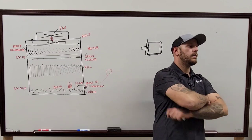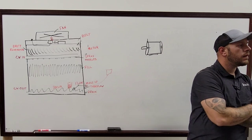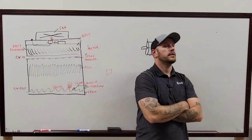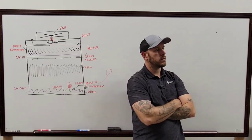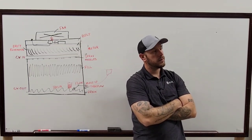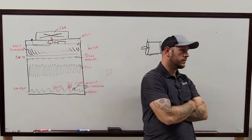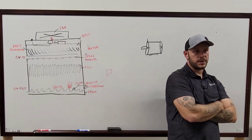Load? Because your system of operations would be going through your heat exchanger, right? And then it's a closed loop, so we would have a heat exchanger. You would go through that, and then as your temperature builds up, you would start your spray pump, your circulating pump, and then as it continues to build up, that's when you would start ramping up your fans. Yes, you're exactly right. It just depends on the load on the building, really.